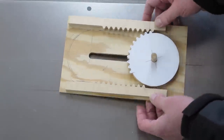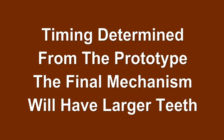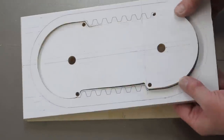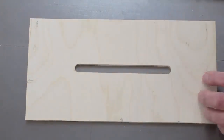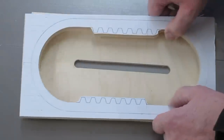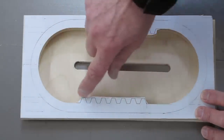Sometimes I can get this to work by gravity. This has been rough cut on the scroll saw. I cut this slot out a little bit tight from this dowel, and I'll loosen that up a little bit. I'll true up this edge on the spindle sander, then I'll finish cutting these teeth for the rack.